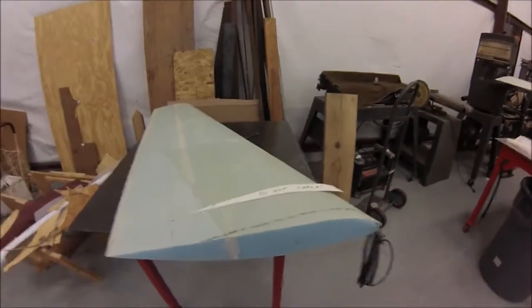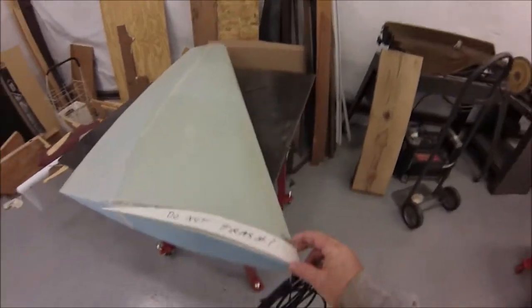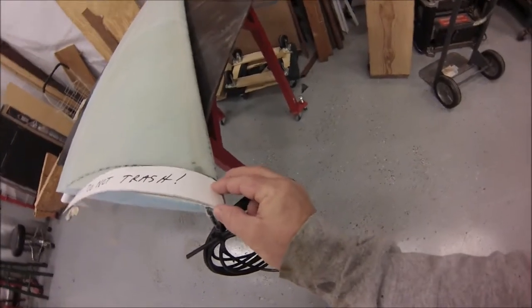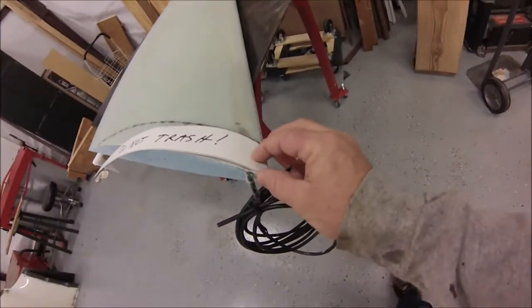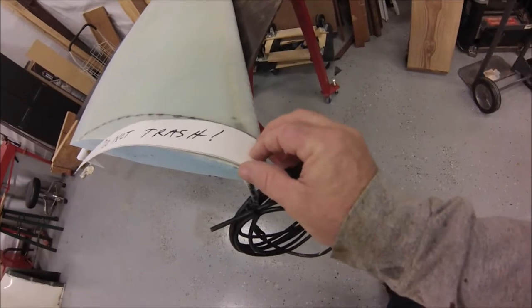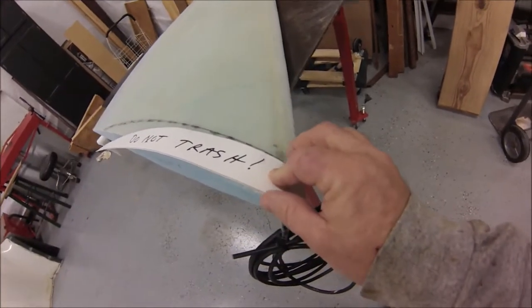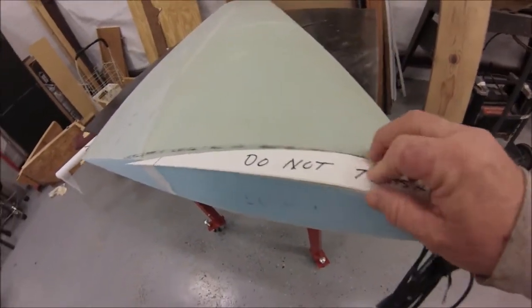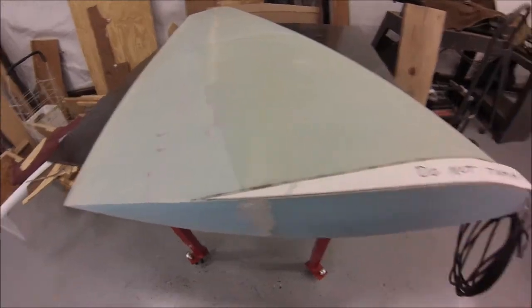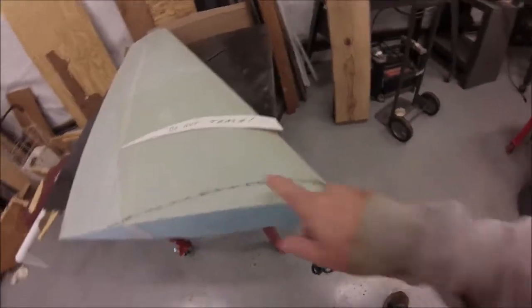I've also started working on the winglets - cutting them to fit the wing. I had some questions about the little cutout, but through talking to the Cozy group, I've decided to put the template like this on the front, making sure the bottom edge is flush with the bottom of the winglet, make my mark up here, and then basically just roll the template making my mark as I go. It turned out like that.